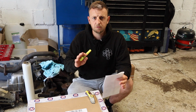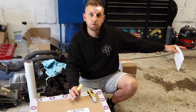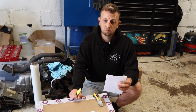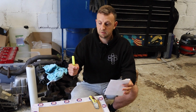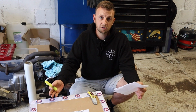If you explain to them what you want to do with the welder, like we said, we're welding up a car, that's what we're going to be using it for, they will advise you if this welder is going to be good enough. You might be looking at the 250 and they go, look mate, you don't need that welder. On a car, you're never going to need to weld anything over a certain thickness, so we'd recommend the 180, it's cheaper and it's going to do exactly the same thing.